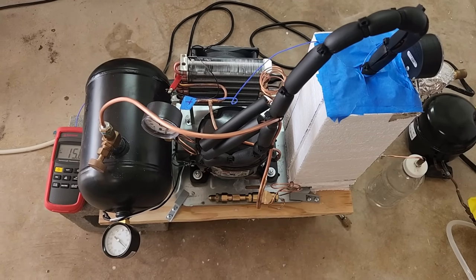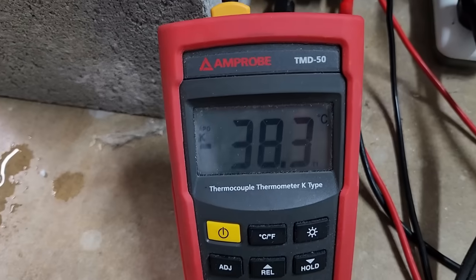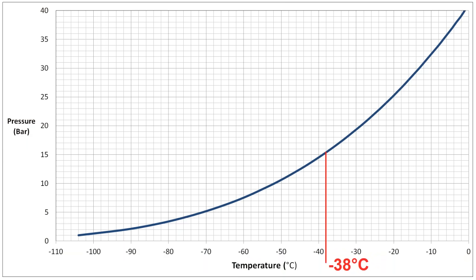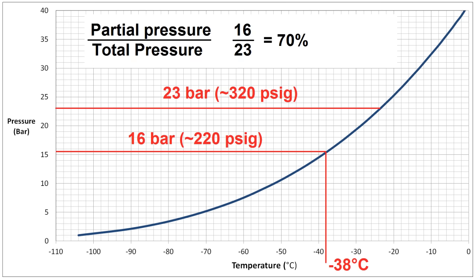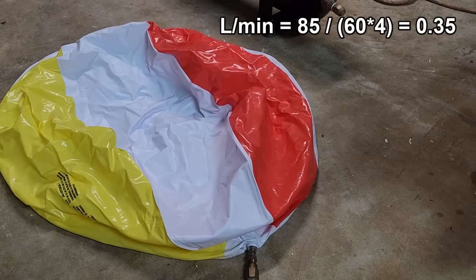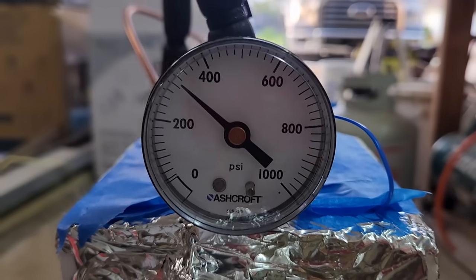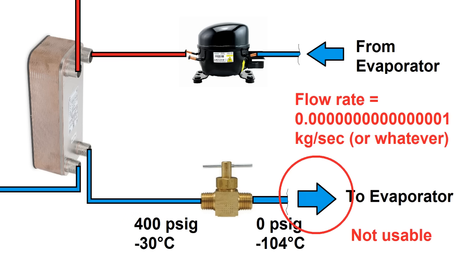Here's the whole setup ready to go. I chill down the collection pipe and then start pumping in the ethylene from my beach ball. At minus 38C, the pressure is about 320 psi or almost 25 bar. This is another red flag suggesting the ethylene is impure, because at this temperature condensation should occur at about 16 bar or 220 psi. Based on these numbers, I'd estimate it's only about 70% pure, with the remainder being either air or hydrogen. Another thing I realized is that while these little fridge compressors can put out up to 3, 4, or even 500 psi, the flow rate becomes absolutely abysmal past around 200. It took me close to 4 hours to pump down about 85 liters of gas, suggesting an average flow rate of about 0.35 liters per minute or 0.012 CFM. The thermal load on the evaporator was so minuscule that I never even saw it move when I began filling the pipe — meaning even if I was successfully condensing ethylene at around 400 psi, I'd be moving such a tiny amount that there would be practically zero cooling power in the evaporator.